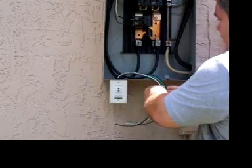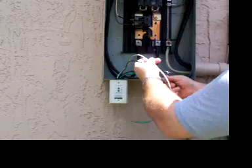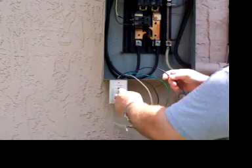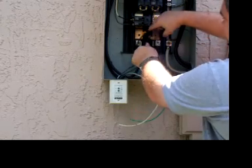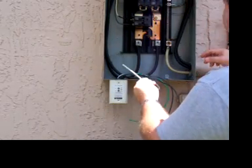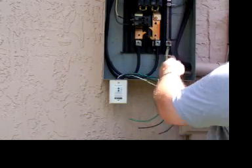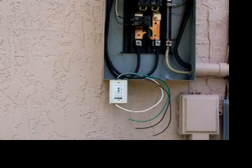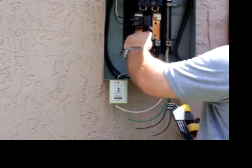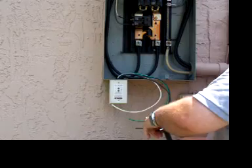The next step: you've got four wires — two black, a white, and a green. This is one phase, the other phase, your neutral, and your ground. It's basically going to go just like this: black here, black to black — hot, hot. For the neutral, look at where the white wires are going — in this particular case they're all going to the same bus, the ground bus. Here's my white and here's my ground. Find an Allen wrench that will fit and away we go.